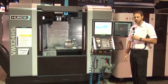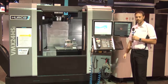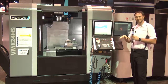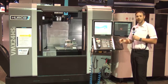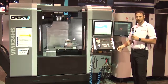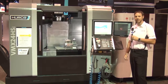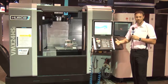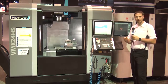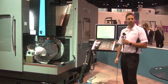Along with this, we've also got a new feature which will allow the robot to dictate what's going to run. This would be good for cell manufacturing. If you had several machines in a cell and a single robot feeding those machines, the robot can determine where the part needs to go. So if you had a machine that just finished a job and the next job in line is capable of being run on that machine, the robot will then send that program to the machine. There's no longer having to wait for a machine or a machine sitting idle — the robot can see if the part can be run there and transfer it into the machine.